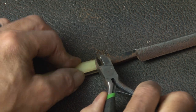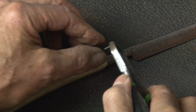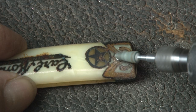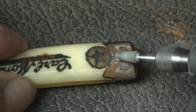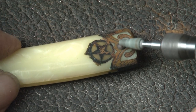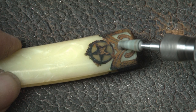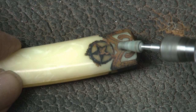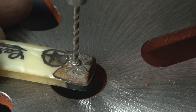I've freed up the pivot pin, which holds the blade in place. Now we've got to get the rest of these pins out. The decorative trim on the ends of the scales is in pretty good shape — I don't want to destroy it, so I'm going to be very cautious. I think I need a little more precision, so over to the drill press with a small bit to get these pins out.